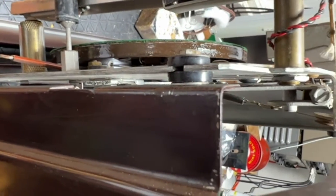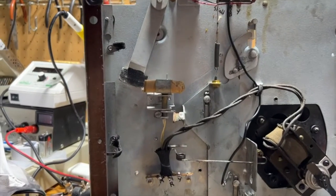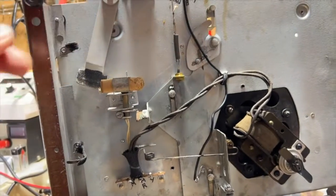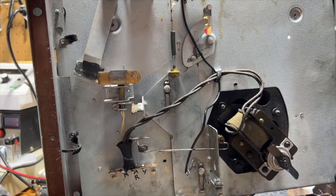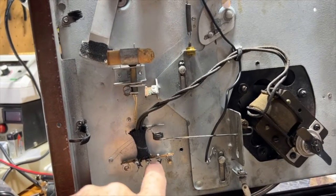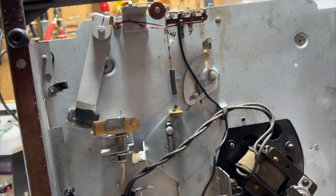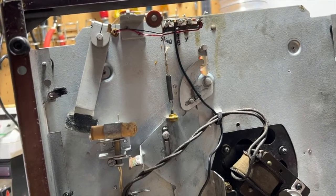My solution is to take that metal piece out, get some plumbing washers from the hardware store, ream them out so they're a little bigger inside but still snug, and stick them on. Maybe they're not quite as rubbery as the originals, but there's a solution. There are the improvised rubber mounts in place. The board has been reattached to the base. I want to attach some wires with disconnects on them so that in the future, if it needs to be serviced again, it won't be necessary to desolder these wires — that's a very poor design. They should have had disconnects.